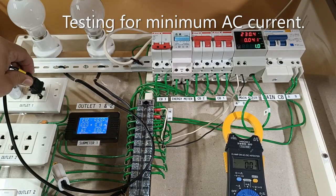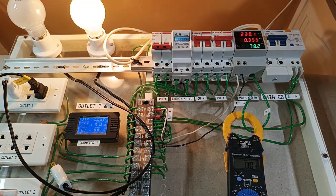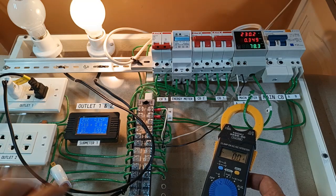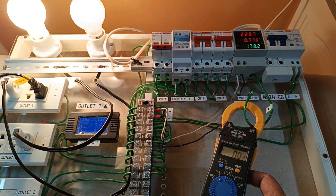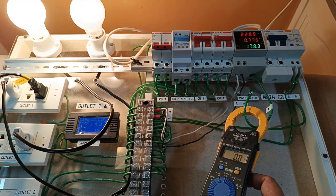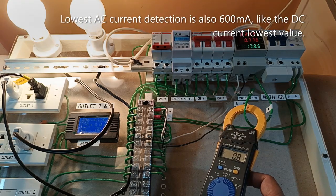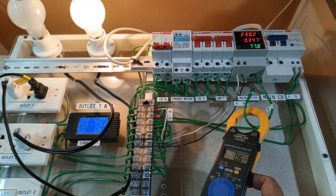In this last example, I've also tested its minimum AC current at 600 mA — the same as the minimum 600 mA DC current demonstrated earlier. Hioki, however, did not provide accuracy specs below 1 ampere, so you need to take that into consideration if you plan on measuring below 1 ampere. In summary, I think Hioki made the 3288-20 mainly for 50 and 60 Hz AC and DC power systems inspections, not for electronic use. Lightweight and easy to use, I think one of the best features of this clamp meter is its stable zero DC current adjustment — you need not readjust the DC current to zero all the time. Please hit the like and subscribe buttons. Thank you for watching. Stay safe guys.